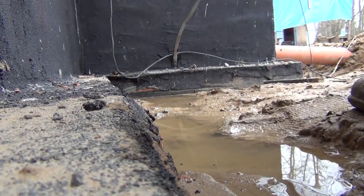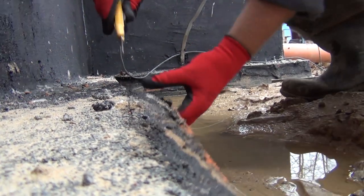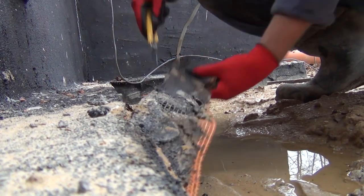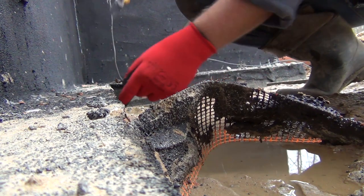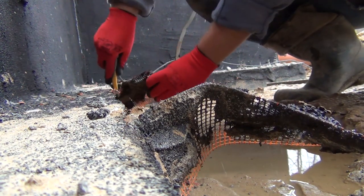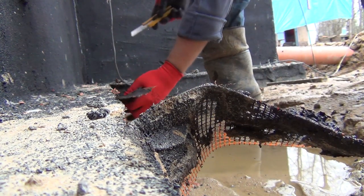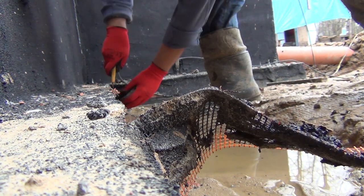Here up front it's basically the same thing as on the back — you can see all this stuff is just lifting off without any adhesive on the bottom. I'm going to cut it out, because it's pointless to keep it here. This mesh was supposed to make a nice seal of the other edge, but I think it's better to just put some extra bitumen mass in here to seal the two layers rather than have this. Pretty bad.